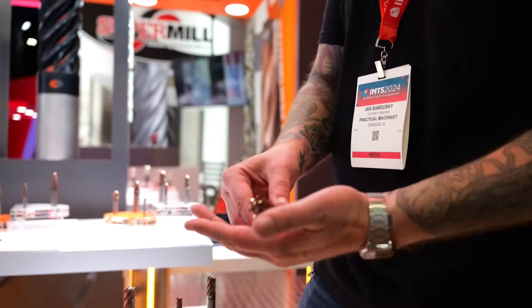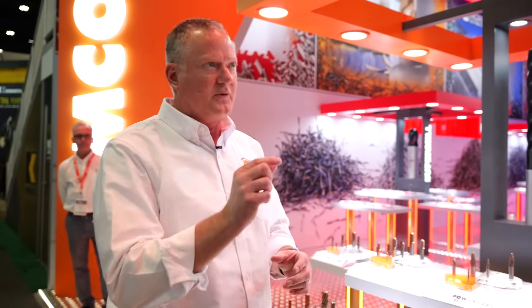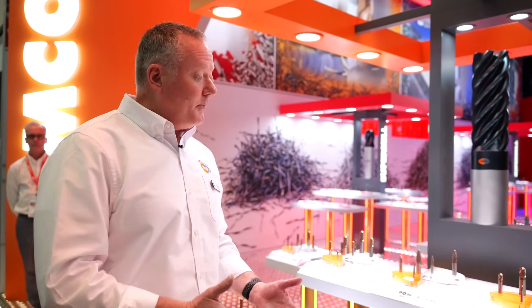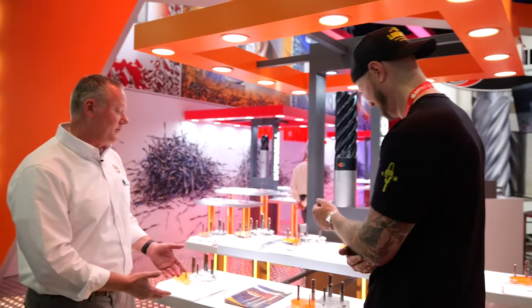We're always very cognizant about making sure that a tool has good tool life, because that's important. But when you think about the overall costs that go into making a part, 75% of your costs are pretty much fixed — you have admin, you've got your machines, you've got the cost of running the plant. So if I double the tool life on any end mill, I'm only saving a small percentage of the overall cost. But if I can improve the cycle time, then we're really saving a lot of money — that's where we're breaking into that 75%. That's what this tool does.